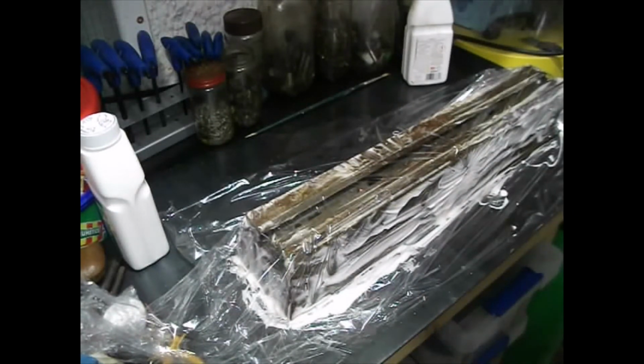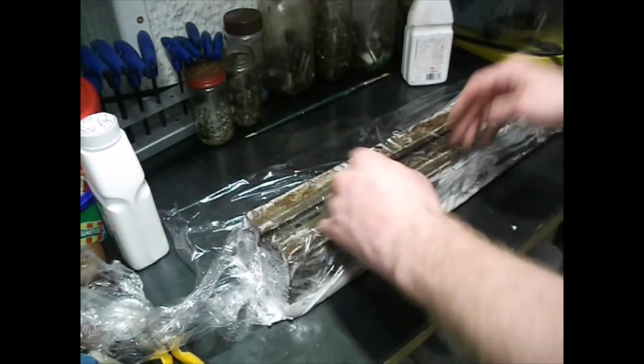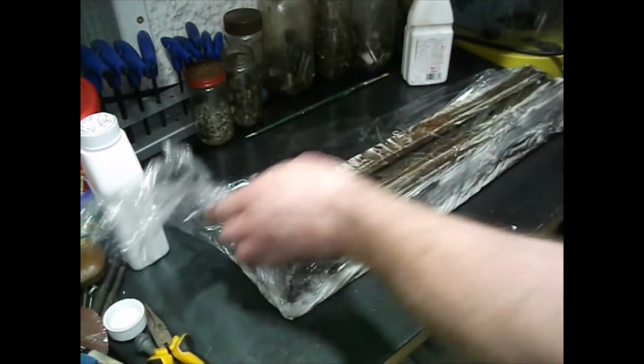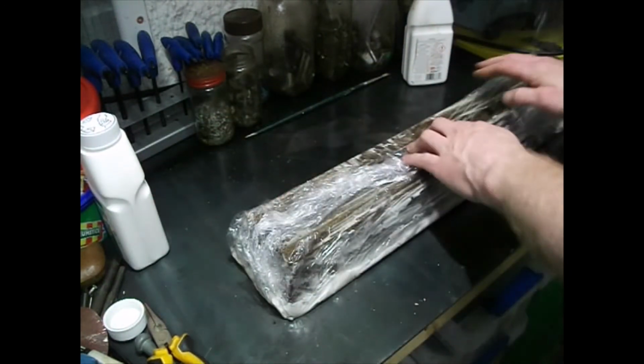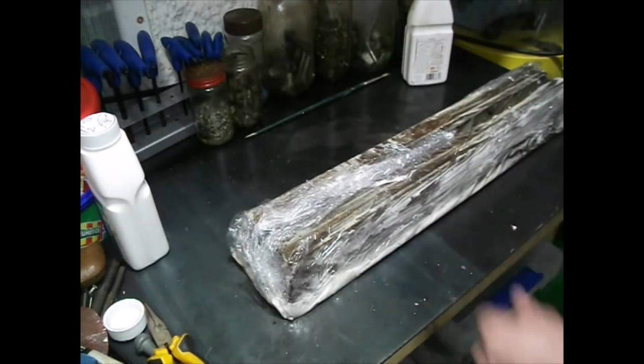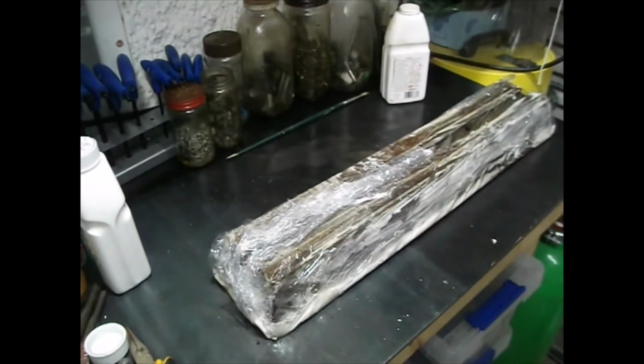Of course, being a solid lump of metal, I could just put a blowtorch onto it and scrape the paint off that way. Again, fumes you have to be a bit careful for. But this, as a way of getting rid of all that old nasty paint and putting nice, I'll say relatively healthy stuff back on. You still have to watch out for the fumes when you're using enamels and primer and so on, so I'll be doing it with the door open. We have a much safer option than preparing this, as I said, using abrasives.